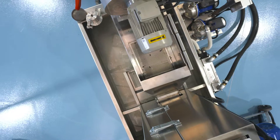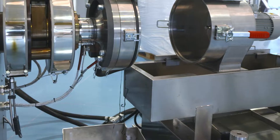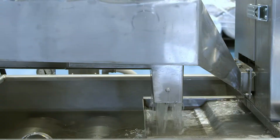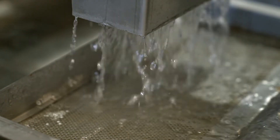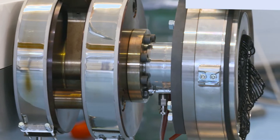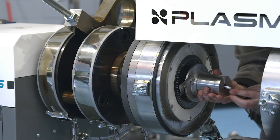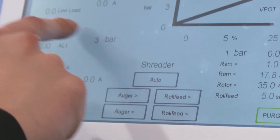The pelletizing system is Plasmac's ultra-compact hydro-cool pelletizing system. The stainless steel cutting chamber is mounted on a linear rail for simple opening and closing. Two pumps are used: one to feed the cutting chamber and the other circulates water from the tank through a heat exchanger and back into the tank to maintain a constant water temperature. As it is a closed loop system, the only water used is through evaporation, which is negligible. A flow sensor with integrated thermocouple means the control system is able to sense that the correct flow of water is being sent to the cutting chamber, and should the inbuilt filters start to become blocked, it will warn the operator that they need cleaning. The thermocouple also allows the water tank temperature to be displayed on the operator's HMI.